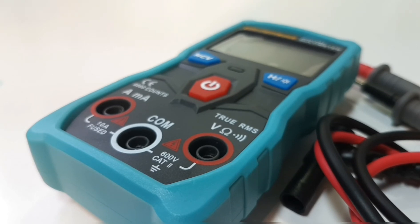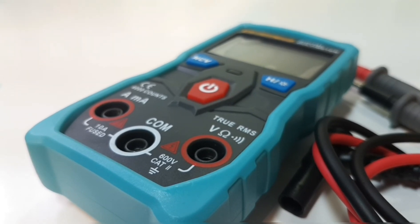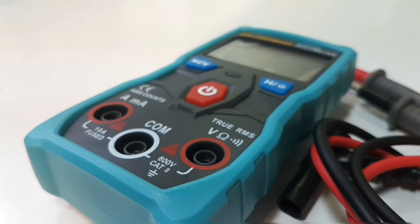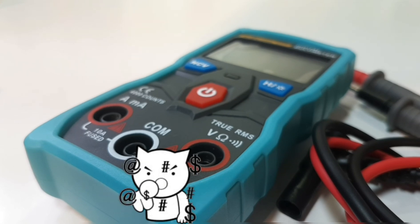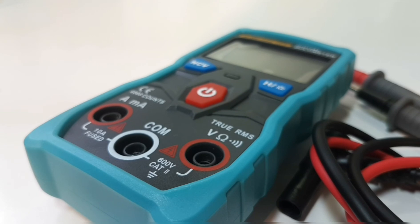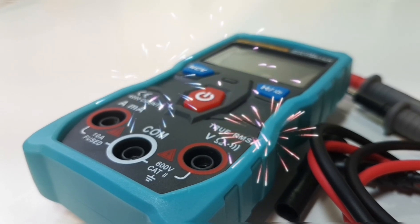Closing thoughts on the Richmeters 403B: I like this meter, but I wouldn't recommend it as a first multimeter. If you need a second, third, or additional meter for the bench, toolbox, or garage, it's a great little addition. It's auto-ranging with nothing to mess with, though caveats include no capacitance or diode mode, slow ranging, and a low-voltage blind spot. I'm a little perturbed that my flashlight LED was missing, but all in all the 403B is a pretty good meter — I'm giving it a solid 3 out of 5. Thanks for watching, and until the next review, keep on testing.